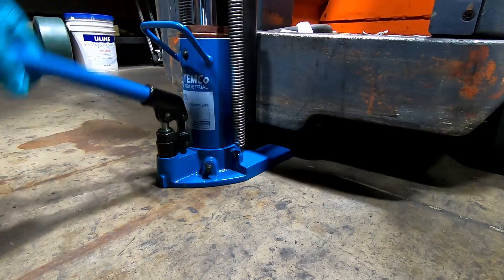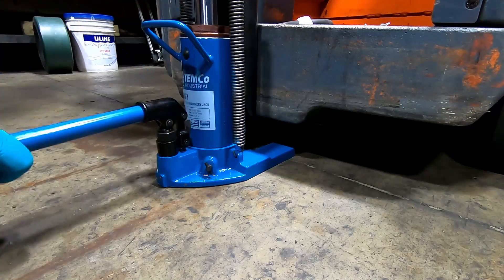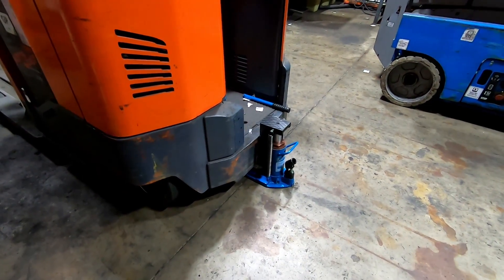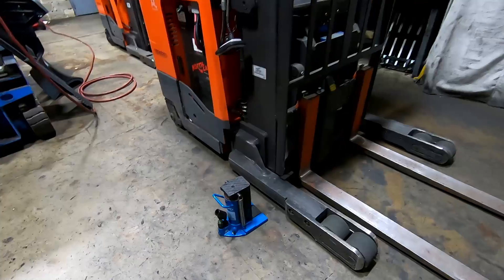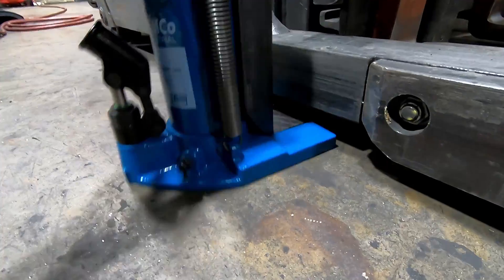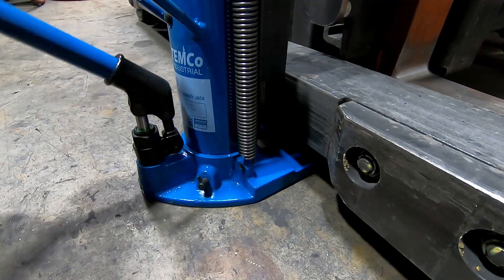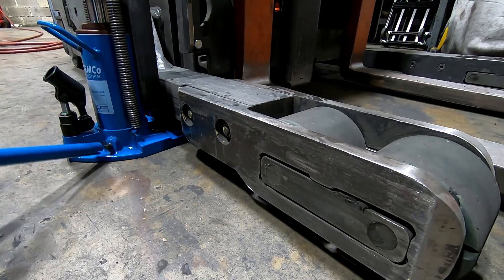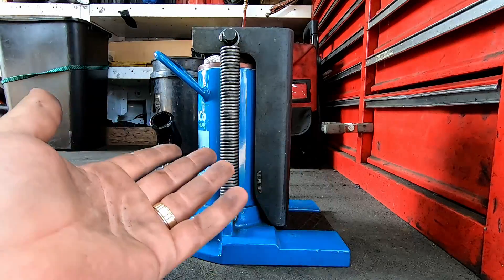As far as load wheels go, a standard forklift jack will normally get underneath those, but sometimes the wheels get so worn out it won't fit — and this fits underneath no problem. Seven-eighths clearance — there's not too much stuff lower than that. Load wheels are where this thing actually shines, because they're always too low to get a standard forklift jack underneath where you want it to be. This thing will tuck right underneath there, lifts it right up, and it's nice and stable. Of course, whenever you're lifting something with hydraulics, always block it — just a little safety tip.